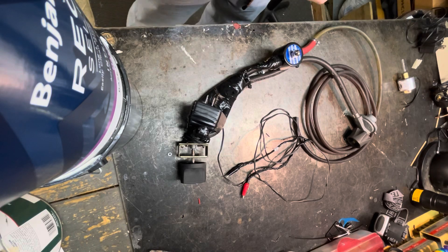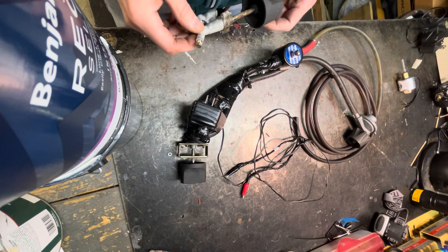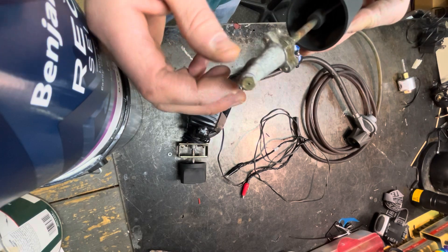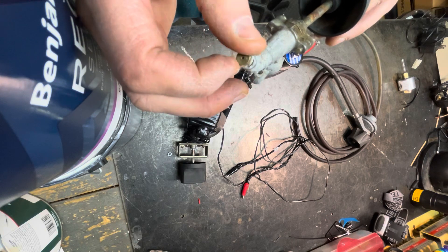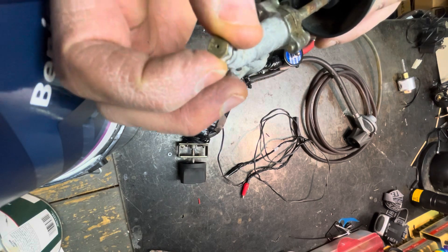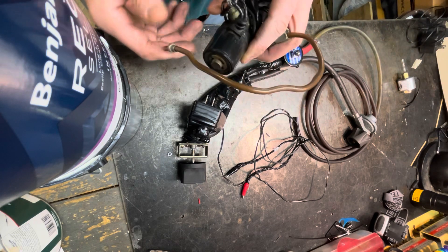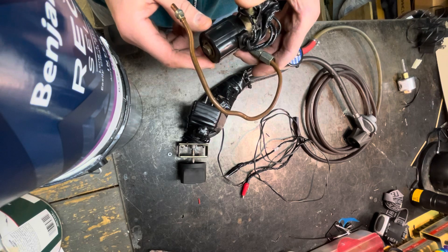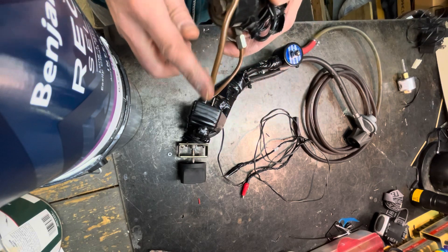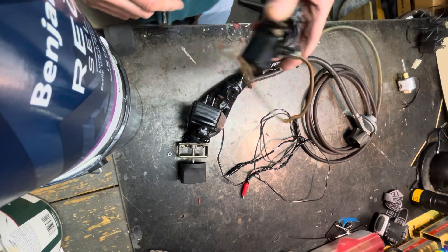This is what I came up with for the propane fuel supply for the generator. First thing I had to do was remove the orifice out of the barbecue control — as you can see, it's very restrictive, it's got like a pinhole. I tried this oil burner shutoff valve and it worked terribly. The engine wanted to almost quit every time because it has such a small hole inside; it doesn't let the gas flow.